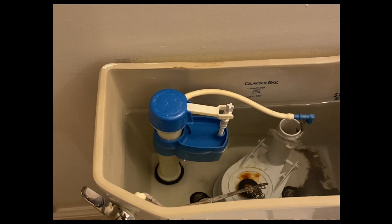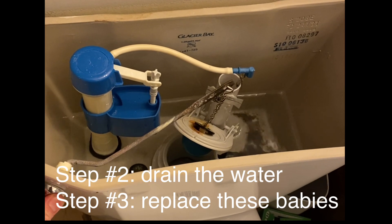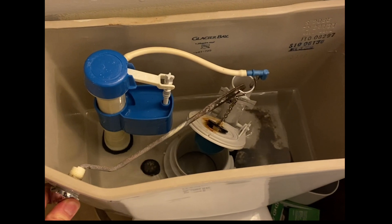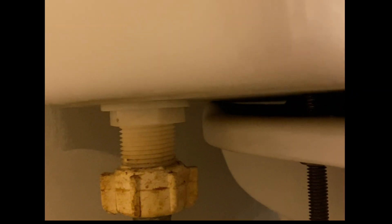Next, let's drain all of this water. First we're going to flush the toilet — this will get rid of most of the water in the tank. For the water that's left, we're going to drain it all by unscrewing this fitting. Make sure you put some tray or container to catch all of this water. I put this jar here — it's going to catch all the water.